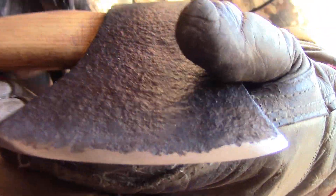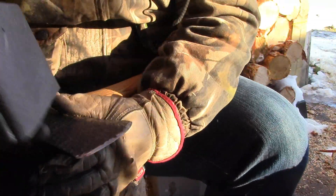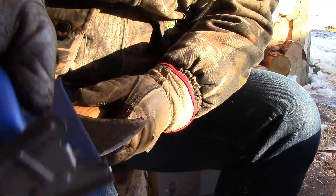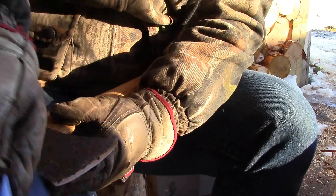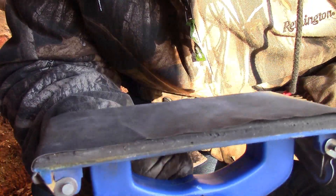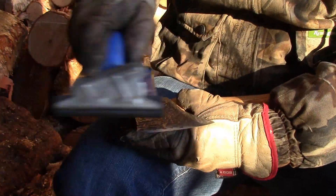Let me give you a picture of that texture off the 100 grit. See, it's very clean — just gives a nice finish. Going to do the other side and then move on to a 400. This is not picky with the grits to use. Obviously if you start with a 1500 grit, you're probably never going to get rid of the deeper scratches. But by starting with this 100 grit, it very quickly takes out those deeper grooves. Here now I'm moving on to a 400 grit paper, which again is a little bit worn.